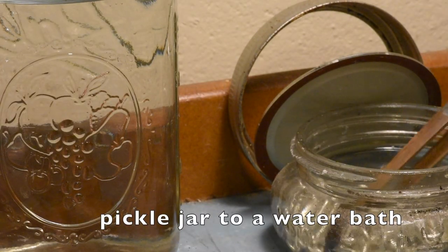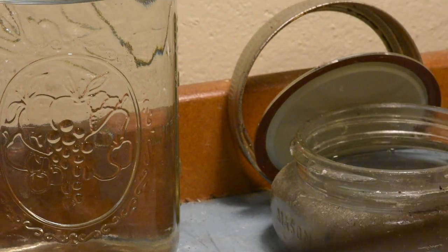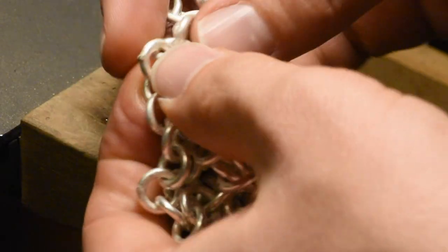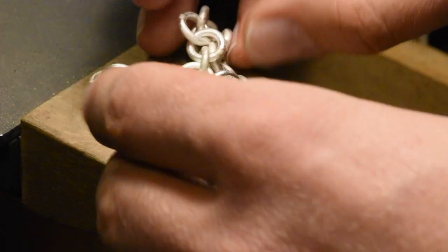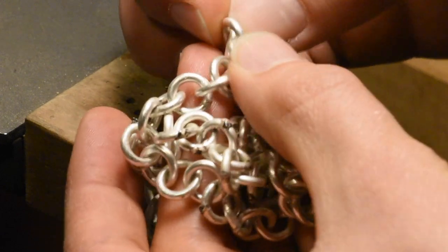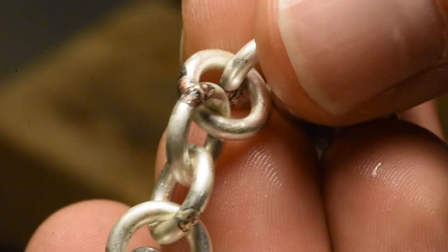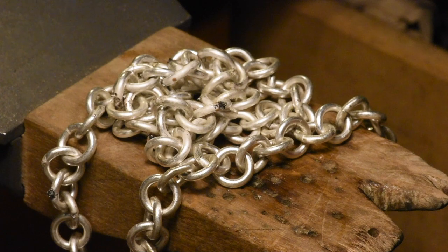I just finished up my last link and now I have to clean them up — I think I'm about five hours in. My soldering isn't so great; there are definitely some bulbs that I'm gonna have to file down, and I'm gonna have to redo a couple of joints because some of them didn't look like they penetrated all the way through. I was running out of fuel and my welds were a little cold, so a couple might break when I do the twisting. But the good news is I think every single link is independent — I don't think I got a single joint that jumped between two links. So that's excellent. Clean and then twist.